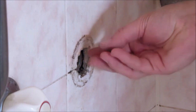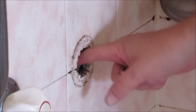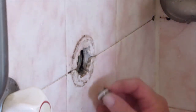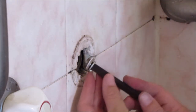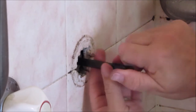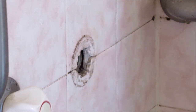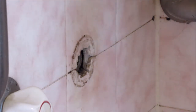Now we just screw this in - this becomes the new seat for the washer. I did spend a bit of time cleaning out all the off-cuts in here, just to make sure there's nothing there, because the rubber washer will actually roll in on that seat and I didn't want it picking up anything that might damage it. There we go - now we have a beautiful new seat to put our new washer in on, and hopefully that will stop our leaking problem.